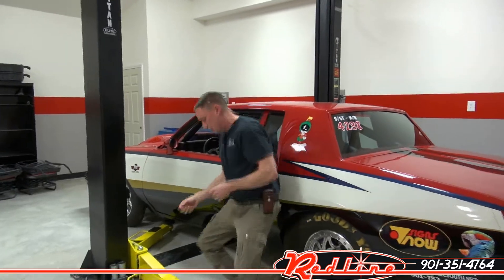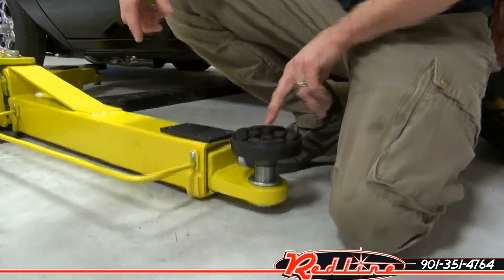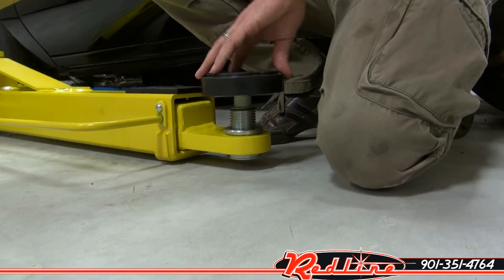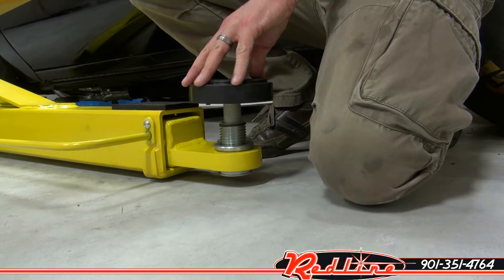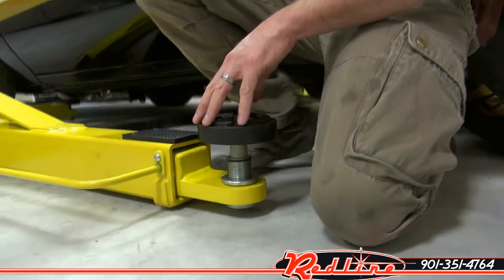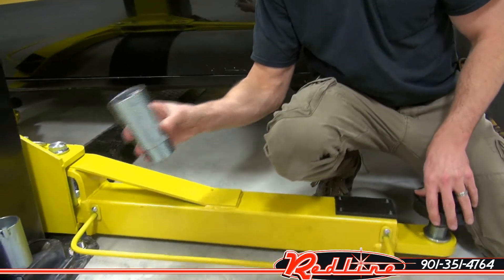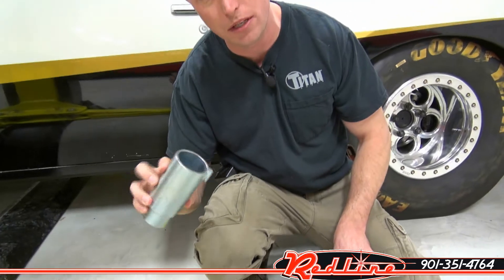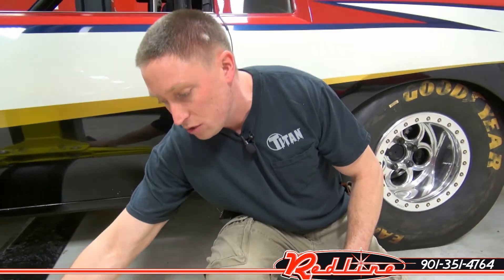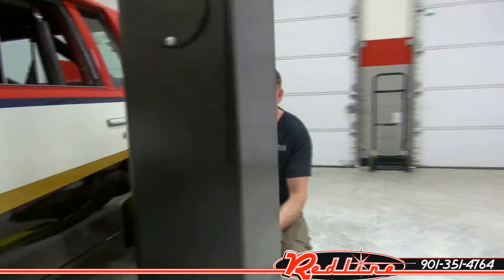First thing I want you to see is this lift has got double telescoping feet. It's got a nice big thick rubber pad on this foot, and you'll notice as I spin it, it raises the foot up. That's a very nice feature so that you can kind of tailor the lift to the vehicle. If you'll notice over here we've also got truck adapters — this is standard equipment with this lift. You don't have to spend extra money on truck adapters, so that will raise your foot up in case you need to do that for lifting pickup trucks.